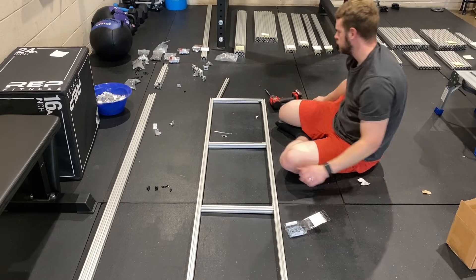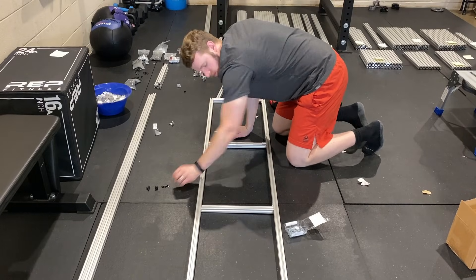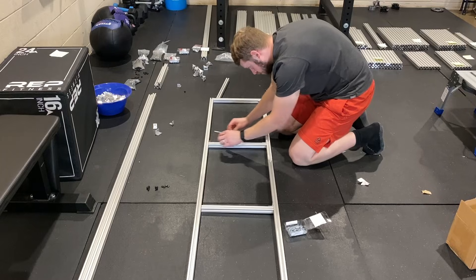Why would you build your cabinets with aluminum extrusion? In our case we had several reasons. First of all, aluminum is really light - it's much lighter than wood, which seems counterintuitive that a metal would be lighter than a wood, but it is. Also right now the price of lumber in mid 2021 is outrageous, so this stuff actually ended up being fairly cost comparative to what lumber costs right now. It's important to us that we keep our build as absolutely light as possible because we are pulling it with a Toyota 4Runner which has a 5,000 pound tow capacity. By framing in aluminum extrusion I can skip a lot of sides and panels of the cabinetry - I don't need a back, I don't need sides, I just need the front face and a few sides here and there.